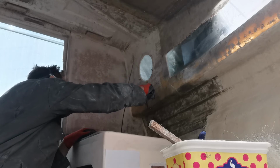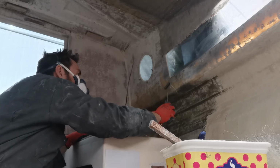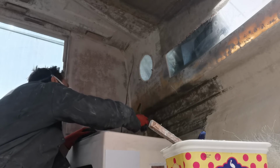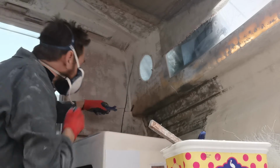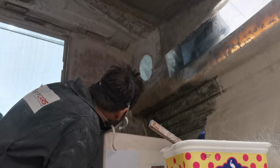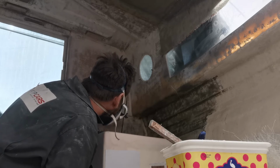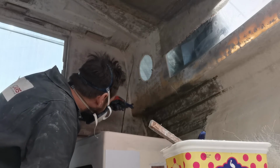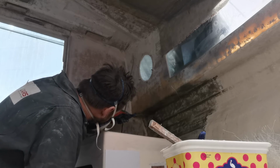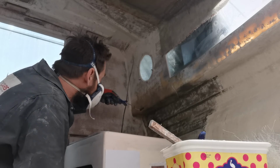Rolled out quickly. Make sure we've got our resin right through it. Pretty flat brush. Quite a nice flat surface, that section, so this will be the challenge, the bit where it rolls around. I don't want to push too hard, I don't want to slide the glass around. I just want to roll the air out, pushing the glass flat to the boat. What I don't want is voids like I had up here.